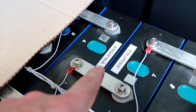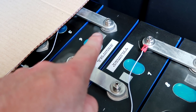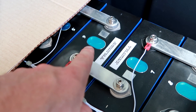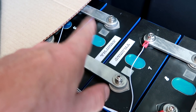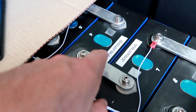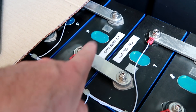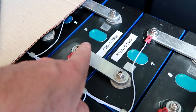These are the connections I made a couple of days ago already, as a test for the bus bars. I may have to clean up the contacts again because it was dark and I was using my torch to get this all done - because when I disconnect the battery, the light turns off. We are off grid. So I'll probably take these ones apart again and clean the contacts, just to make sure there's nothing wrong with cell number 6, and then we test again.